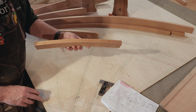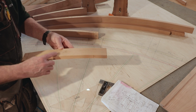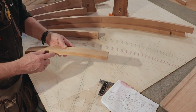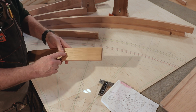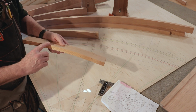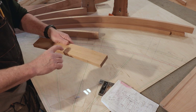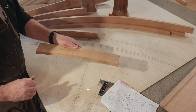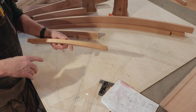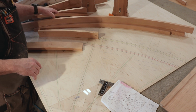You can see the lines, and that's why we don't shape this, because if you were to put a shape like the raised panel molding shape, it would look so stripy, it'd be ridiculous. And you think, oh, well, it looks like grain. It doesn't. It looks really weird. And if you even have a little bit of a wobble in it, it looks like a U. So your piece would look like it has something like that in it. And that's not good. So we just make them out of solid stock. And we got plenty of that.